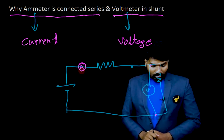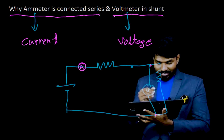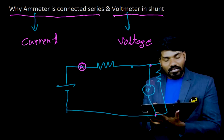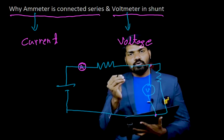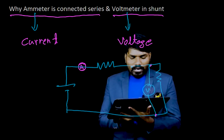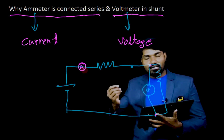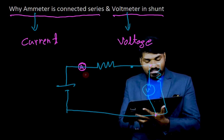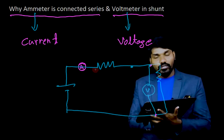There are different ammeter technologies — if you are using a special ammeter, you don't even have to break the circuit, but that's a different matter altogether. So voltmeter connected in shunt means voltmeter connected between those two points, because I want to measure the voltage between those two points. When connecting an ammeter, I want to measure the amount of current passing through that conductor, so I place it in between that conductor.